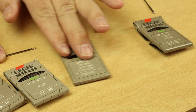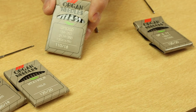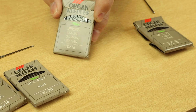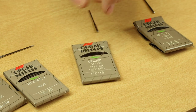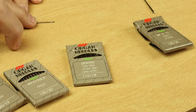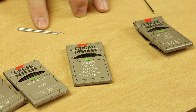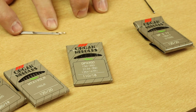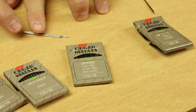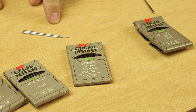The H3 uses a 134-35 needle — it's just a different, smaller needle system. The H3 doesn't have high lift, so it doesn't need as long a needle. In the foreground you can see the 134-35 needle, which is much shorter. In the background is the 190 system needle — I didn't measure it, but it's a good quarter inch longer.